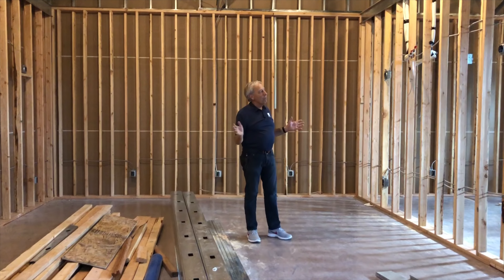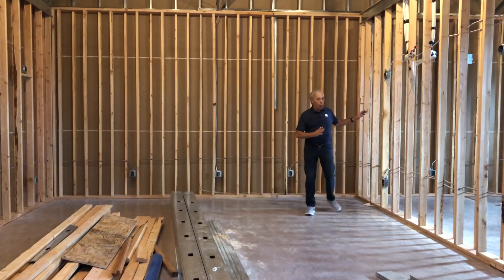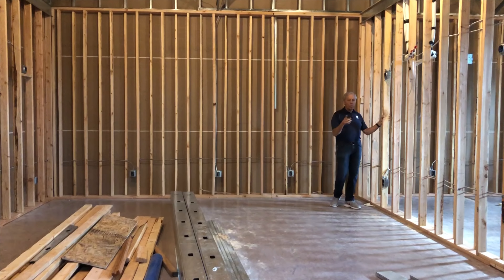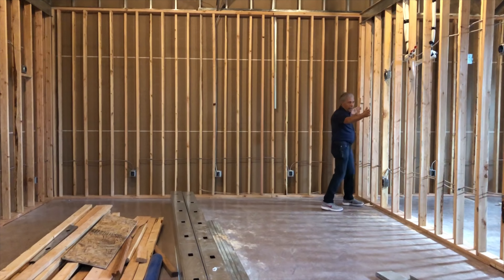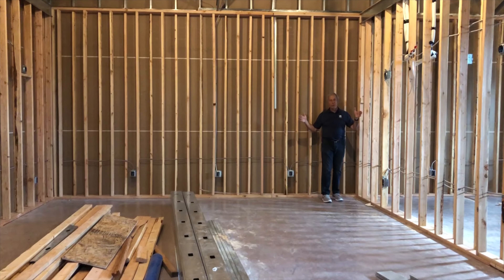I'm going to give you an overview today of how we're going to build this, and then as we keep building it, I'll keep photographing as we did last time so you can see what we're attempting to do. This wall is a dividing wall between Music Room 1 and Music Room 2. What's unusual about this wall, that you cannot see right now, is that it's at an angle — skewed by 6 inches, so the back of this wall will be 6 inches closer, to give us less of a parallel wall for standing waves.